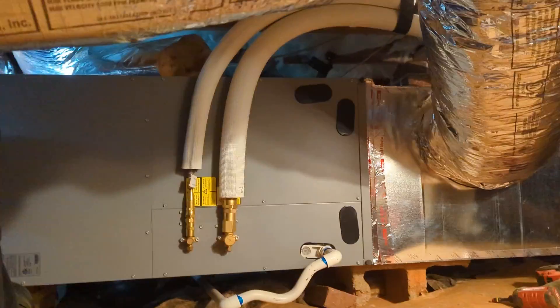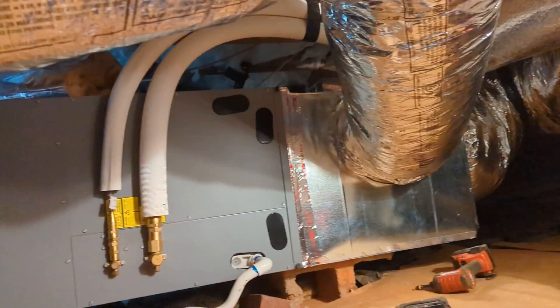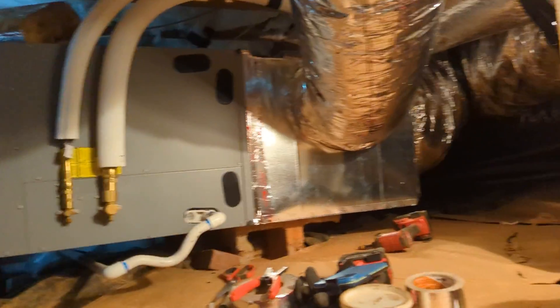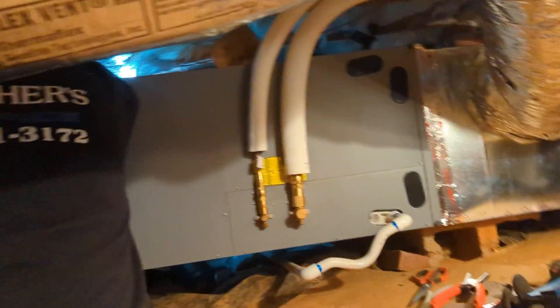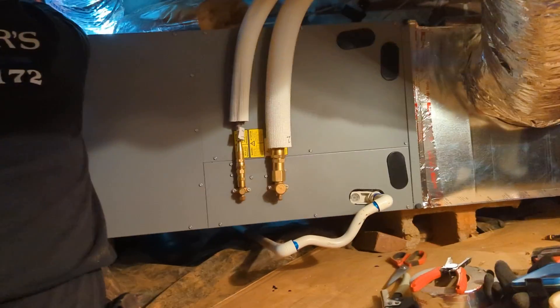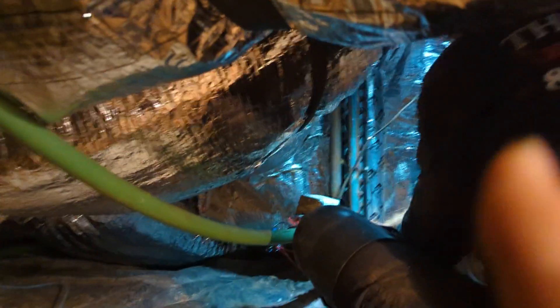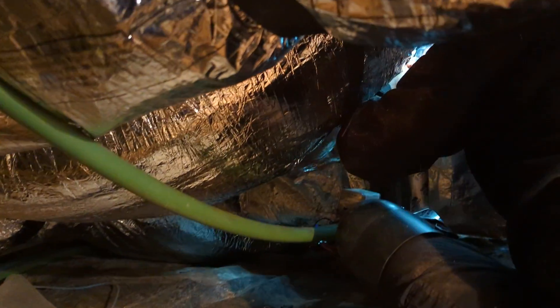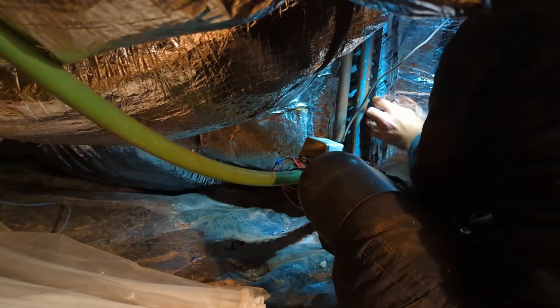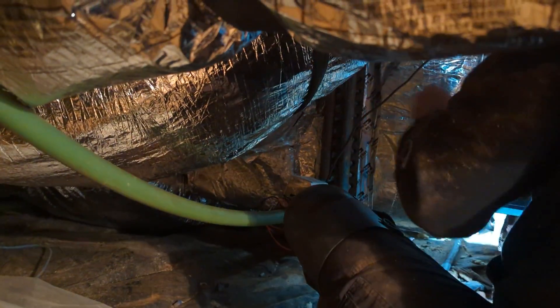A lot of progress has been made getting our HVAC back in business. We built a new plenum and added two three-ton air handlers — one is actually running now. Pretty excited — not as excited as my wife, but awesome. Condensate and drain lines are in. They're working on insulating the plenum right now. I still have my wood boiler coils in here — the PEX lines going to the old coils — because I can't help myself. This is wired up a little differently, and I'll explain the thermostat setup and how we're using a 24-volt valve to control water flow to the radiators.